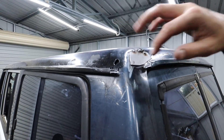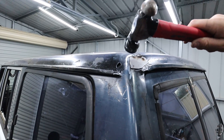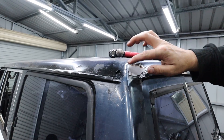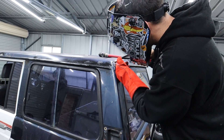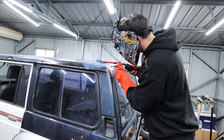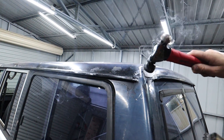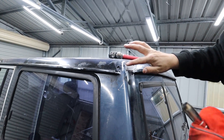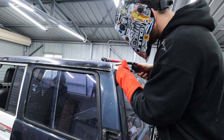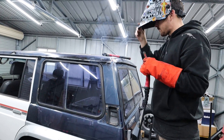You can see here there's actually a lip on here, but you don't really worry about that too much because you just work that down. And now that's flush in that corner, so you tack it and you move down the line. This is just to help you keep the profile. So that's dead flat now. Just keep working it along.